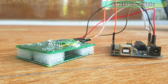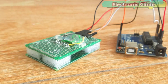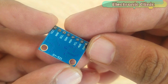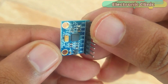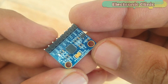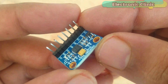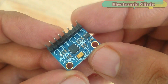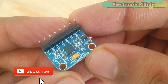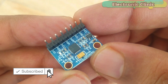The components and tools used in this project can be purchased from Amazon. The purchase links are given in the description. This is the GY-521 MPU6050 6DOF 3-axis gyroscope and accelerometer module. The MPU6050 communicates with the Arduino through the I2C protocol. The MPU6050 always acts as a slave to the Arduino with the SDA and SCL pins connected to the I2C bus. This module needs 3 to 5 volts.